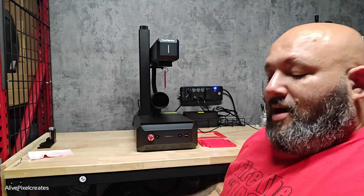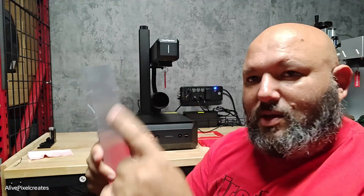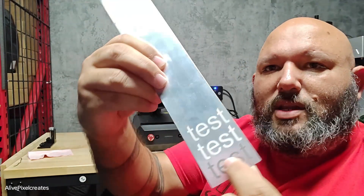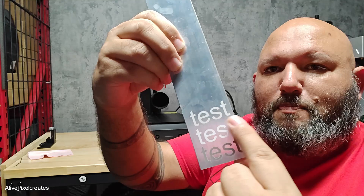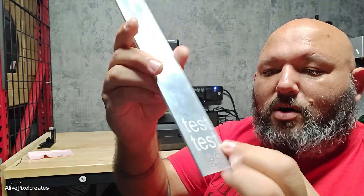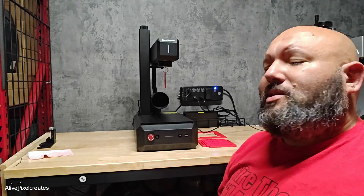I did something here really quick and I'm going to put a quick video so you can see how fast it goes — and it can go actually faster. This is really nice because I got a perfect white — perfectly on the spot white — on the aluminum, and you can get different colors with the Mopa because the frequency range is huge.